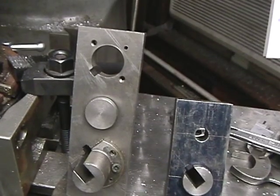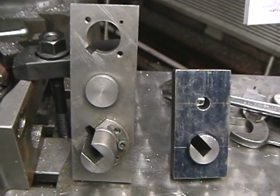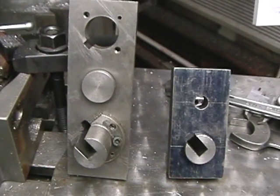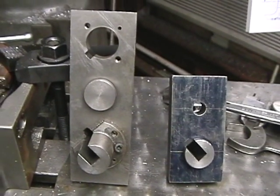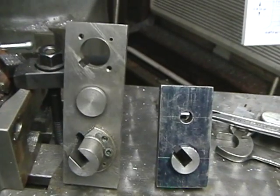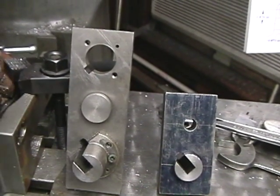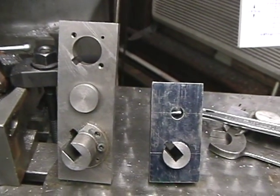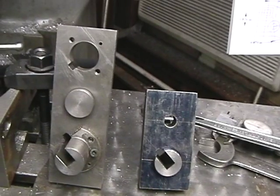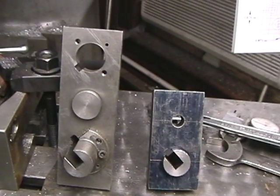This is how I do it. I hope this has cleared things up for you — give it a try, it's a really easy method. You use the ordinary Minuteman broaches that you can buy from a supply house. They have a little shim that goes in: you cut the keyway first without the shim, then put the 1/16th shim in and it shaves another 1/16th out of the keyway. A 3/16th keyway seems to be sufficient — I've never needed any more than that. It works great, good luck with it.